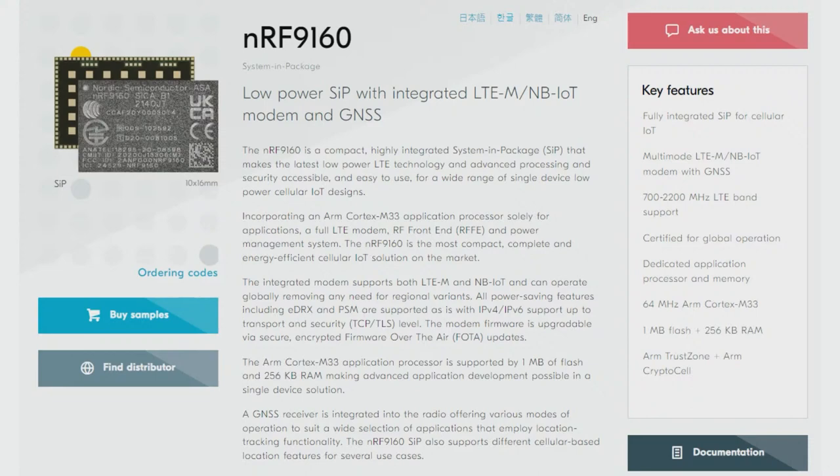The NRF51 started this idea of having a soft device where you have the microcontroller and the radio bonded together in a module or chip. You don't have to have a separate microcontroller, it's designed for low power, and it's designed for being very inexpensive and very small because you don't have two things communicating. That same idea carried through the NRF51, 52, and NRF53 series. They then took that idea of having the radio and microcontroller together and did the NRF9160.